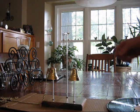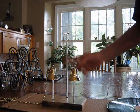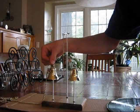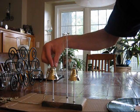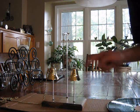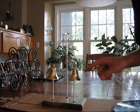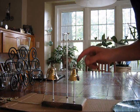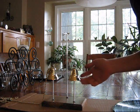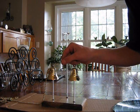A brief description of the reason it works. Opposite charges attract and like charges repel — we know that much. So this bell is neutral, but for this sake we'll call it positive because it simply doesn't have as many electrons as this bell. And this is our negative. So we've got a positive and a negative, and then this ball here. This ball is originally neutral, which we're calling positive, as this terminal is negative when I charge it. So the ball wants to move towards the terminal.